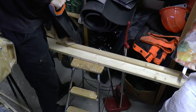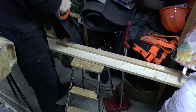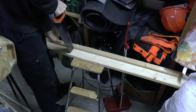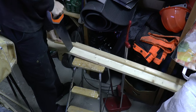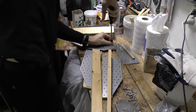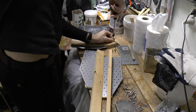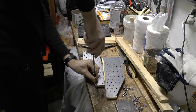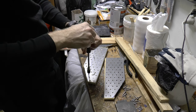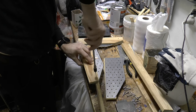These are for the two front sliders. The steering slide would have just two plywood support sides. The front sliders would need to be separated to provide size stability for the ice boat — two one-meter-long pieces will do. Now I start dry fitting the pieces. I use small screws as most of the load will be taken by epoxy, finding the hole positions by first screwing in the screws from the opposite direction before screwing them through from the intended direction.